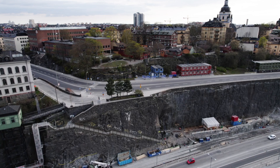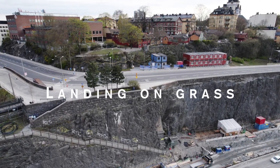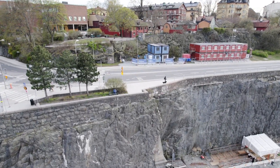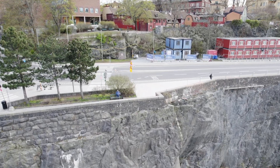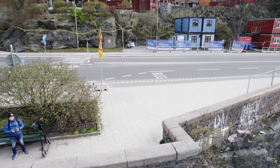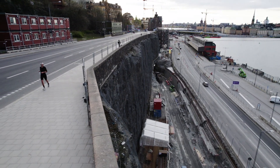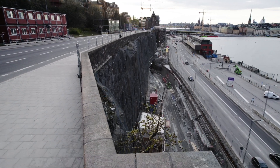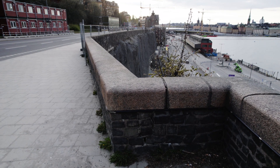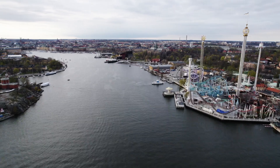My recommendations: if you have the 'Gimbal Motor Overloaded' message, first look at your gimbal for any dust — if you've been flying over grass or in areas where particles could enter and block the gimbal. This recommendation came from DJI chat support. Second, try to calibrate the gimbal — do it a couple of times, especially before flying. And if you're going to clean the gimbal from dust, please don't use compressed air, because that can damage the electronics. Those cans sometimes have liquid inside, and if held sideways they can release liquid and damage the electronics.